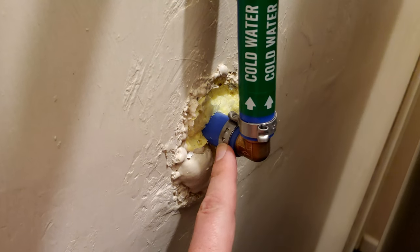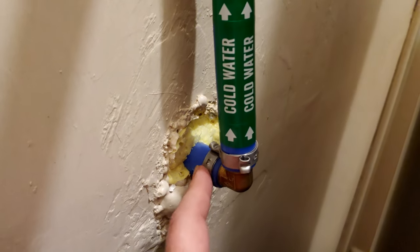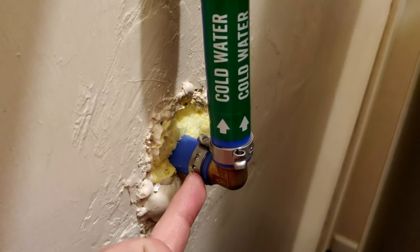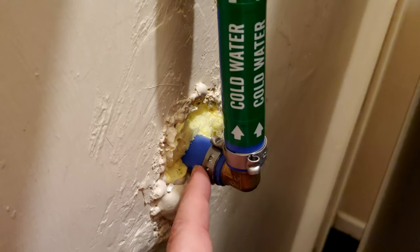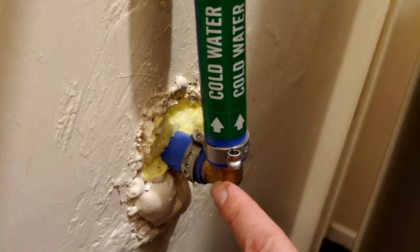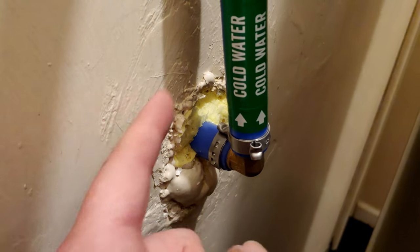I'm here at the main water line that comes into the house and as you can see I don't have a lot of access. I had a bad elbow that had been scored previously, and the only way to get that elbow off because of the copper ring was to cut the pipe back. With limited space, I was really hesitant to put on another copper ring, because if there was any leaking, I couldn't get the removal tool in from this side — I would have to cut again, and at that point I'd have a major project involving getting behind the wall.